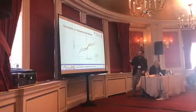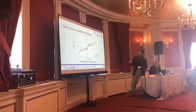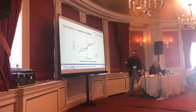So in the following slide we see the behavior of the system. We were able to capture the behavior of the system in a numerical environment using MATLAB, and then we are able to implement it in analysis and design software, as I will show. It's worth mentioning that, as you can see, the system could achieve almost perfect, very excellent self-centering behavior with good energy dissipation. So as I mentioned, although we could achieve the experimental results in a MATLAB code, but for